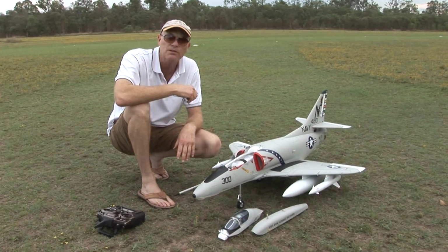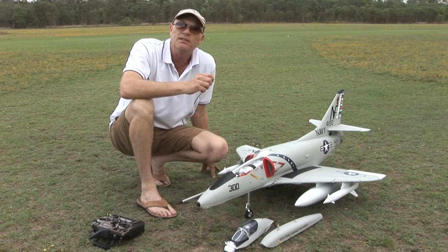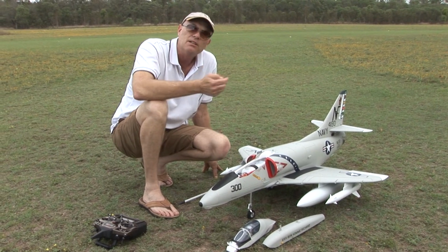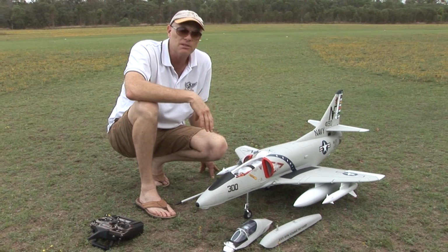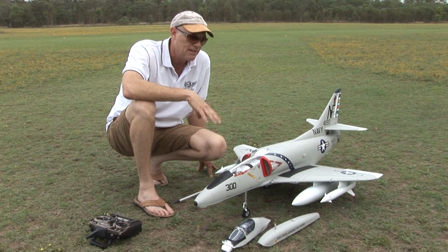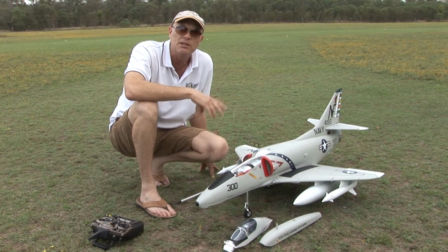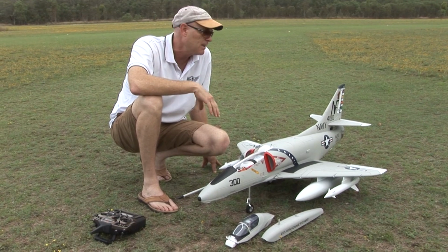They do say glue the other spars, which are your locating spars. That's fine, there's a separate spar on each wing. Locate them, glue them, that's all good. And then the wing goes together beautifully. Do your screws up, you don't need to do anything else. It just works. So just watch that central spar, make sure you get it centralized in the fuselage first, and you'll be fine.